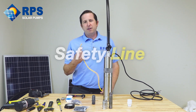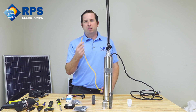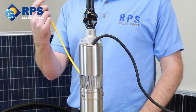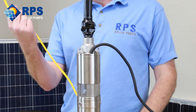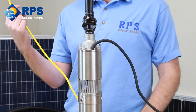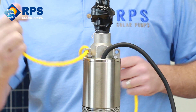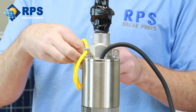A safety line is not required for your installation, but it is recommended. It's a quarter-inch polypropylene yellow cord, available online or at any big box retail store. This is a secondary safety measure — in case your drop pipe breaks, you'll have a second way to pull up your well pump. All of our pumps come with two connections for the rope. Pick one, insert the cord through the connection point, and tie a good knot. We recommend a bowline for a nice, secure connection.